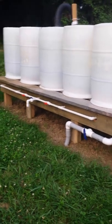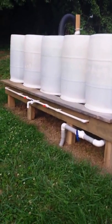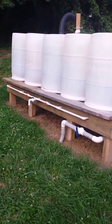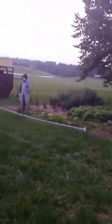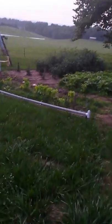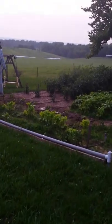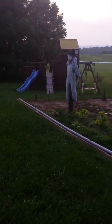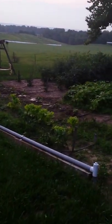So what I did to fix that problem is I ran 2-inch pipe underneath the base and connected it to 6 of my barrels, and I turned that valve on there on the 2-inch pipe, and the 2-inch pipe runs underground 50 feet all the way down to my garden, where it pops out from underneath the ground back on top of the ground, and I've got a 30-foot feeder tube basically at the front of my garden,